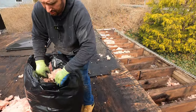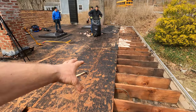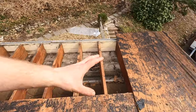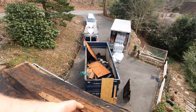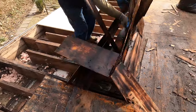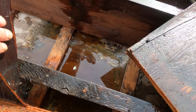On a scale of one to ten, how bad is the plywood? Twelve. Some sheets look relatively okay, but when you get to the end of the sheet, the plies are just coming apart — it's definitely time to replace this plywood. We knew the roof was really bad, but we didn't know it was this bad. The crazy part is look at all that water — there's like a puddle in there, actually sitting on top of the sheetrock right now. What a discovery. Just one thing after another. Let's get back to stripping.